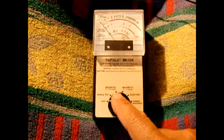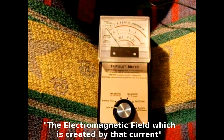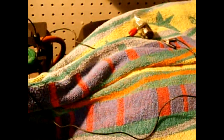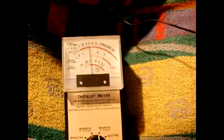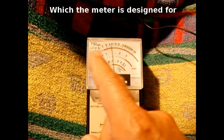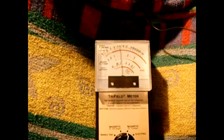What the meter is looking for when you put it to the magnetic setting is current that is flowing — this is going to show you the current going through the circuit. I'm going to give you a simple demonstration using direct current showing how once the circuit is completed to this three-amp incandescent light bulb, you're going to see an electromagnetic pulse on this meter. Because it's not alternating current, you're only going to see the initial pulse — the scale will jump up when that electromagnetic field is generated.